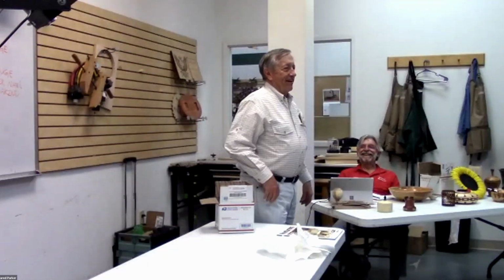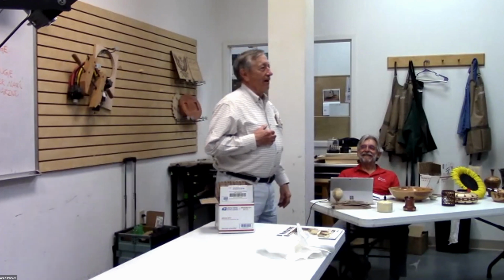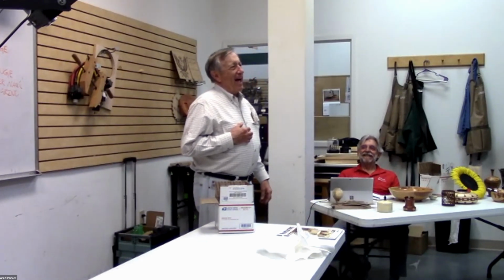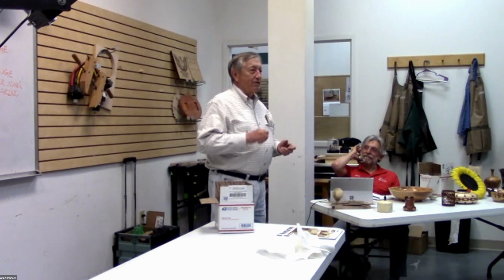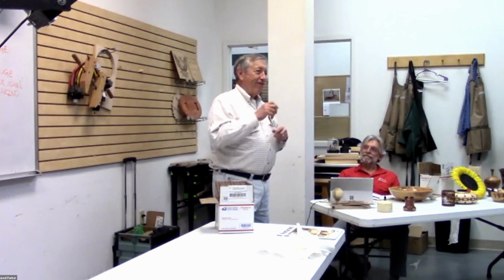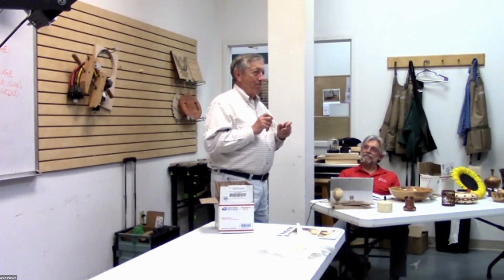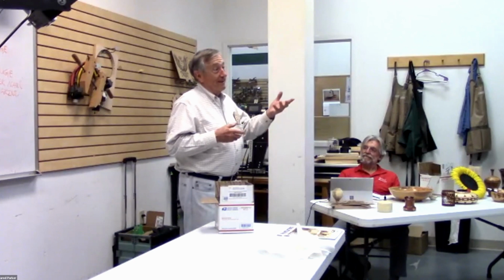Can you say a few words about what tools you used to carve the first bowl? To keep the ridges? How many hours sanding? Well, it's a piece of battlefield cherry, I think, and it probably has about 10 hours in it. It's one of those power carvers. You lay it out, you power carve away most of the stuff. Then you take files and file it down. Then you take sandpaper and sand it down, then finer and finer grit. It was my first attempt at carving a textured bowl, and it was fun and looks pretty decent and came out okay.